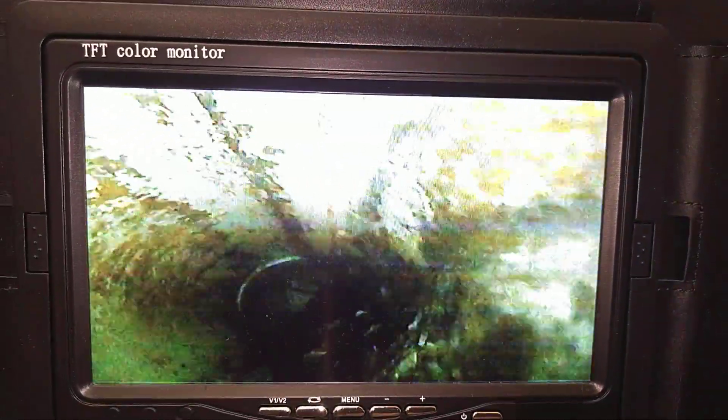The jetting got a lot of that taken care of, which I'm happy about. This is where a lot of the buildup was situated that was blocking the line — as you can see, there's still quite a bit right in that particular spot. The top of the screen is the bottom right now, so that little bit there did not want to come out with the jetting. We'll run the jetter down one more time to try and get all this debris pushed out into the main line.